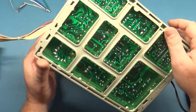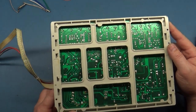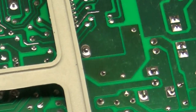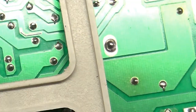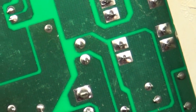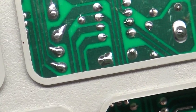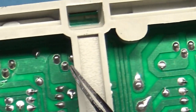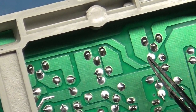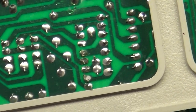We want to look at the bottom thoroughly for our solder joints. I was looking at this earlier and you can already see we have cracks on this heat sink right here — this joint is already cracked. We can look at the rest, but you want to inspect this very, very well. All of your adjustment pots — inspect them to make sure none are loose. If your vertical size pot is not soldered in and you fire this up, you're going to take out your vertical IC. Go over this with a fine-tooth comb before even considering powering it up.